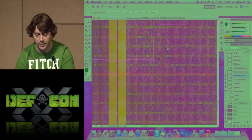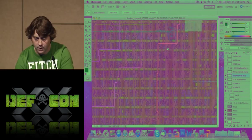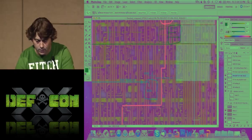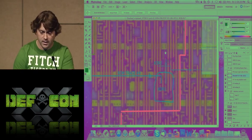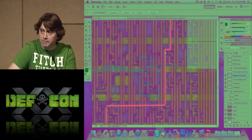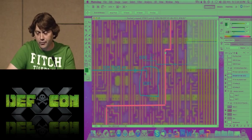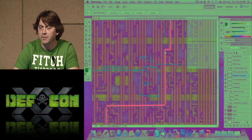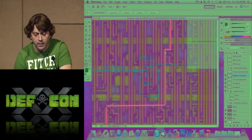Metal 3, it's not so easy to see. We can see, boom. And then I even have some notes here still. So ST has this little thing they're doing, and it's funny because Dr. Karsten Nohl and I have a bet going right now to see who's right. I say that XOR 1 is decrypting the ROM fetch, and XOR 2 is re-encrypting the decrypted ROM fetch before it goes out on the open data bus. This way, if you eavesdrop the open data bus, you'll see scrambled data basically.